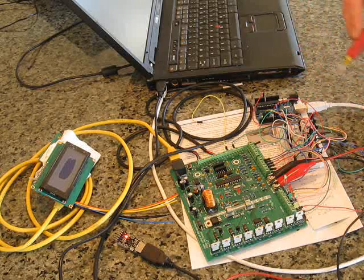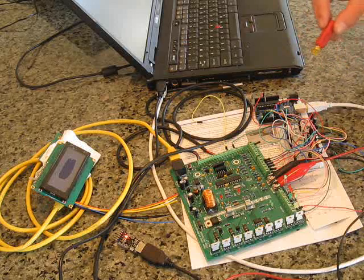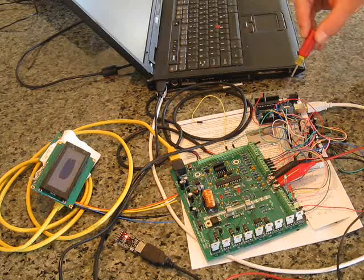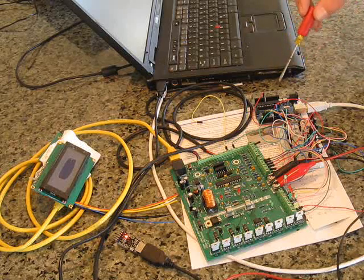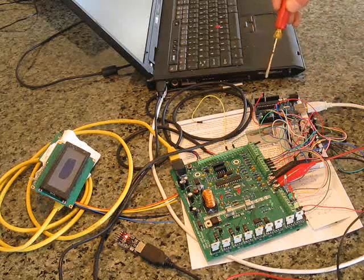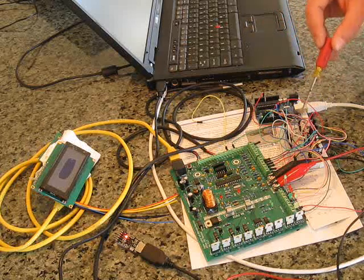With this here I'm simulating how the DC generator with its battery will respond. I just wrote a simple program in the Uno to monitor field input and then slowly adjust the reported back battery voltage as well as current using various level shifters.